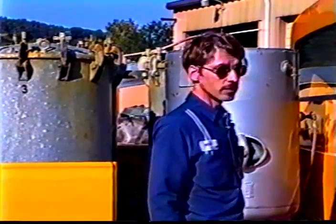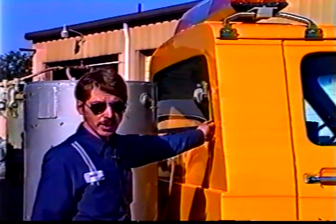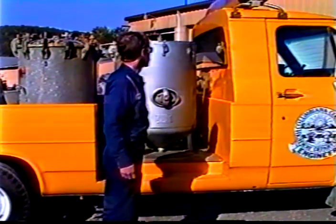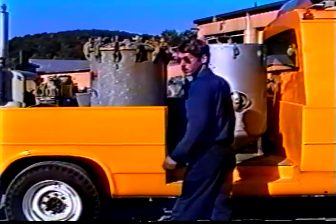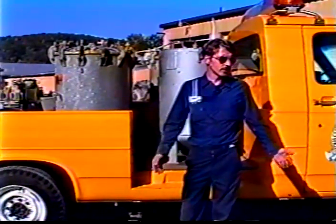Okay. I'm Mike Pettigrew. I work for the Columbiana County Highway Department. I do body work here. They wanted me to tell you about this van. Cut it up across the back, down the side. Welded this back in here. I put this window in it out of a Chevrolet pickup truck. They wanted this left open to get access inside the bed here so I could get to the glass beads and that. And I reinforced the inside of here with channels of metal I had bent up. And we cut it across here and welded a channel in here to reinforce the side. I think that's about it.